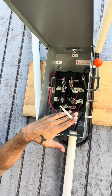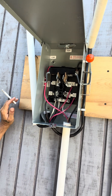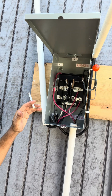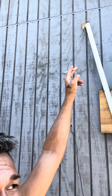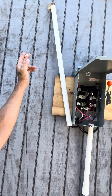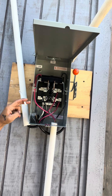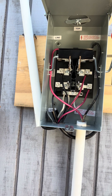Your neutral bar and this transfer switch is right down there, so this is very basic and primitive — and I like that fact. The electric company's two hots are in the top, the neutral is on the neutral bar. We were already hooked up to solar, so this wire running through the sky goes to our inverter in our energy room, which went directly to our house and our main breaker box. All I did was cut that wire right here, run the house wire to the center of this switch, and the inverter is run to the bottom of this switch. Their neutrals are also in the neutral bar.